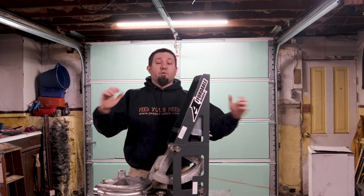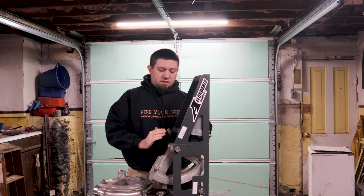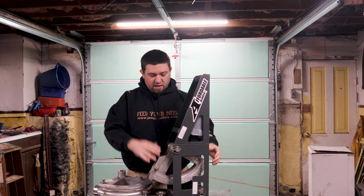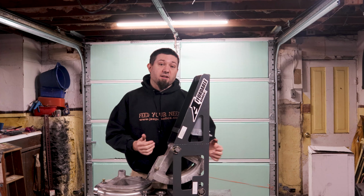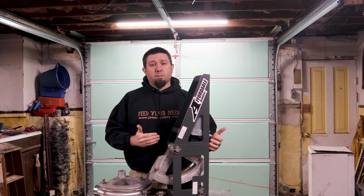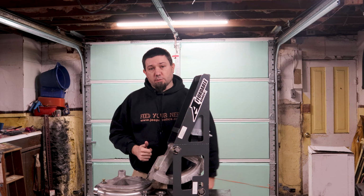So, with all that out of the way, what I'm going to do now is get you some real close-up shots of things like the edges of the steel and how these joints look, what sort of attachment points we have for all these different pieces, like the pivot point of the die and how the jack is attached. That way, regardless of my opinion, you can make an informed decision on whether you think the build quality of the affordable bender is top-notch or not. So let me get you off that stand and get you a close-up look at this bender.